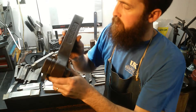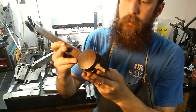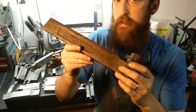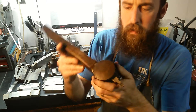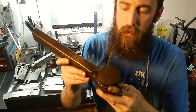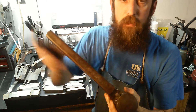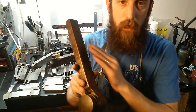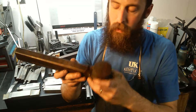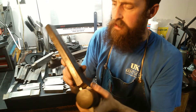Starting off, one of my favorites is the big number 42 Williams. It's a big universal tool holder — holds half-inch blanks, drop-forged in the USA. I'm sure this is much older than I am, but it's the biggest one I've ever seen. For a shaper, this is a prized possession in my opinion. It'll allow you to cut from the side at an angle, allows you to extend quite a bit, and it's fairly strong — really a good cutter. I got this with the shaper. Everybody who has a shaper needs one.